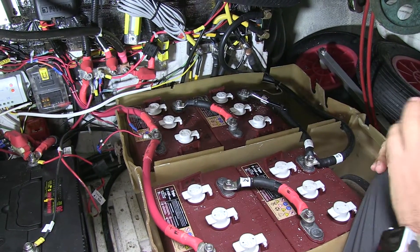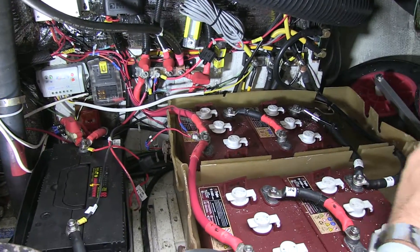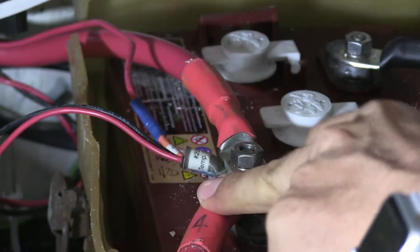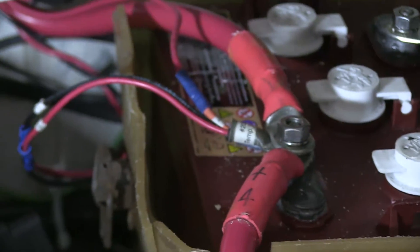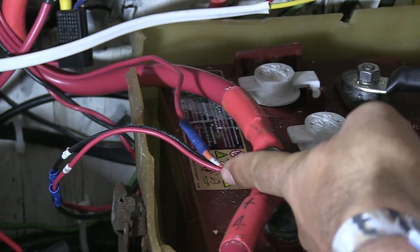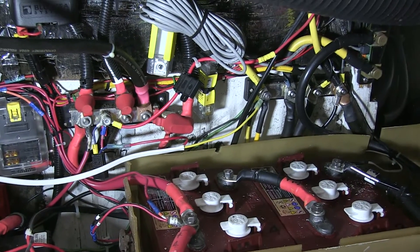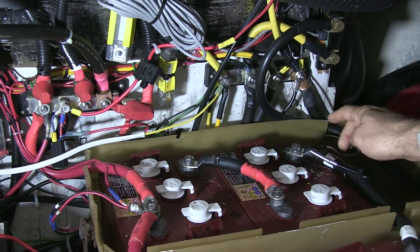One thing I'm seeing right at the battery level is this terminal on the positive is starting to be pretty stacked. You have one, two, three, and four connections. Now this is misleading — it looks like a connection, but it's actually a temperature sensor connected to your external regulator, and we'll talk about that later. Realistically, it doesn't need to be there. It can actually be, and ideally should be, on a negative connection, so it could easily be moved to this one here, considering there's not much on that connection point.